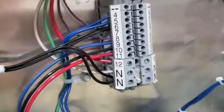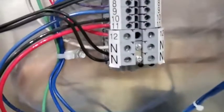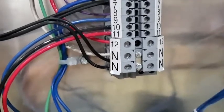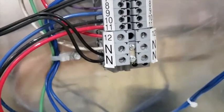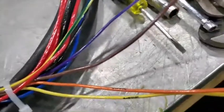Okay guys, here we are at the L53. Different row of terminal blocks, a little bit different. You'll notice on the neutral there's a jumper in there, so both of those ends are neutral — that crosses. So even though there's only one neutral wire hooked up, both sides work for neutral.